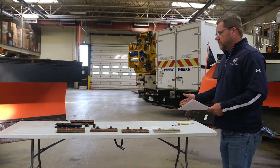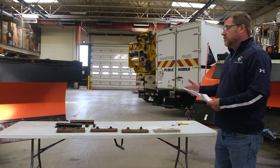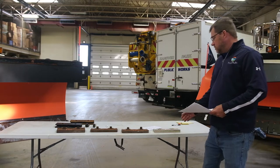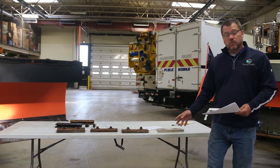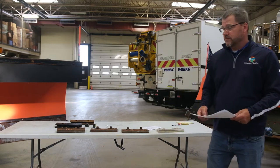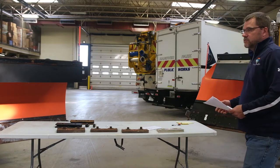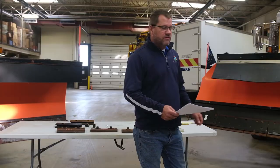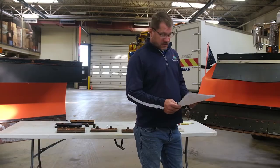With the PolarFlex setup, one of the selling points was that if you hit a manhole and damage the blade and break a section, you can replace just one tooth. Knock on wood, we haven't had to do that yet. The only items we've had to replace is the corner piece — it will wear out. It is not a carbide blade saver, just a corner piece, and it can be replaced without replacing the blade. It does not need to be replaced as a set.